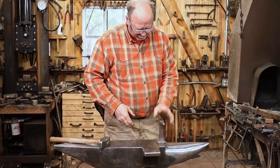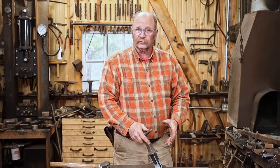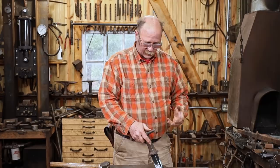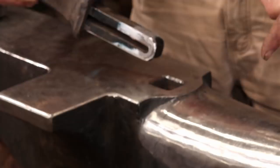This U-shaped hardy shank that used to take a wedge is way too short for use with this anvil. That extra mass under the hardy hole and under the pritchell hole is part of what makes this anvil so much better — things aren't so bouncy. Even that 300-pound anvil, when you get way out at the tail where the hardy hole was, it had just enough bounce and vibration that it was robbing you of energy while you were forging. So this is better, but if I want to use that wedge I'd have to replace these with much longer shanks. That also makes them harder to store, so I'd rather keep them at this length if I can.